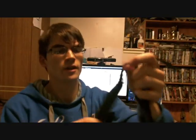So once we've checked the waist part of a harness, we need to go down and check out the leg straps. Okay, harness is held upside down now, the two leg straps. Very much the same buckles. Check them out, see if there's no damage. So the first one there, check out if it's got no damage on it. Then check the strap to see that we've got no damage. Go to your other leg strap, do the same thing.